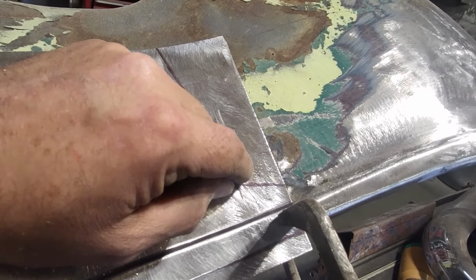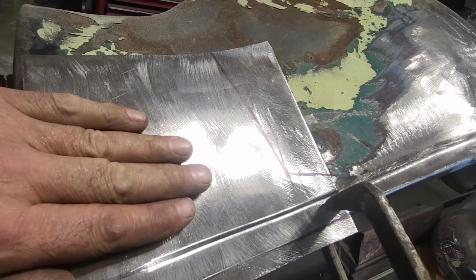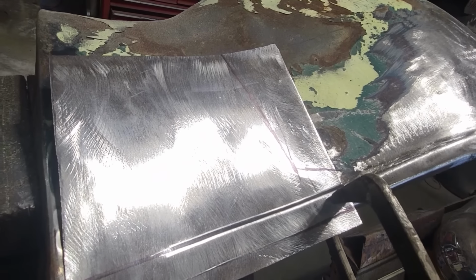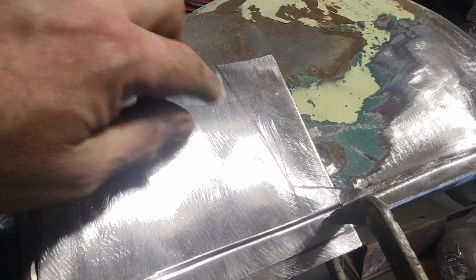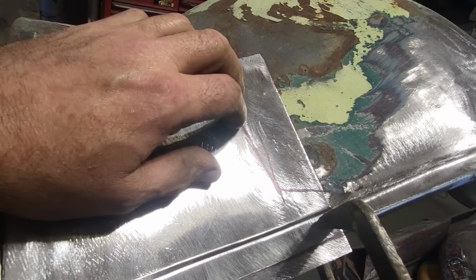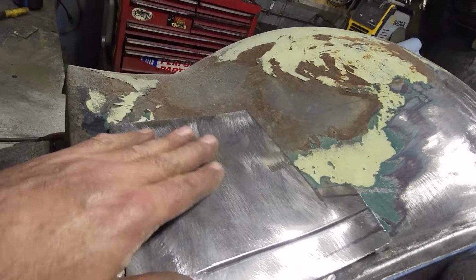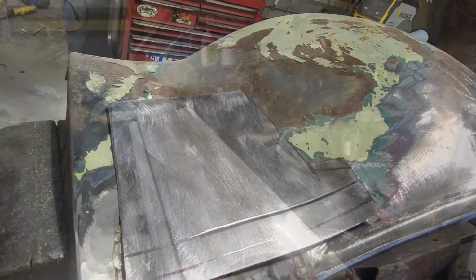So I'm up inside that there. I'm going to come a little bit higher up there and then cut that off there. And that way I could probably take this then and roll this with ease. Be a lot easier to do that. I could sit down and bead all this, try to get that to flow, but I don't need this piece up here, right? So cut that off. So I've got that trimmed off there now. I'm going to go over the pipe anvil now and just give that a little roll.